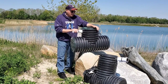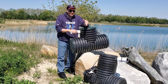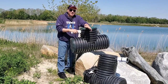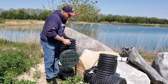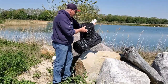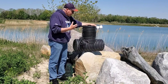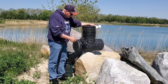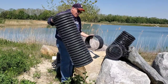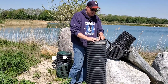People always ask what's the difference between the micro and the full frame. The micro fits in smaller places — egress windows love it. If you just have a small hole collecting water and need to dig and drop it in, that's the one. Also, smaller packages mean no freight charge. Our full frame has to be sent on a pallet, but the micro can be shipped in a box. The micro has a Zoeller M53, a one-third horsepower pump. You can take the end plate off and add chamber length — people buy three feet of additional chamber.